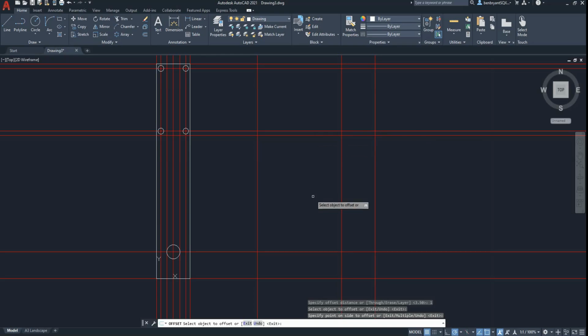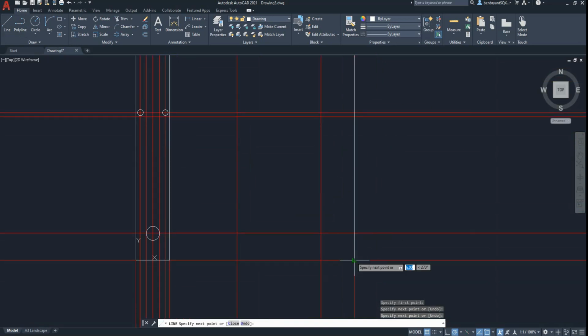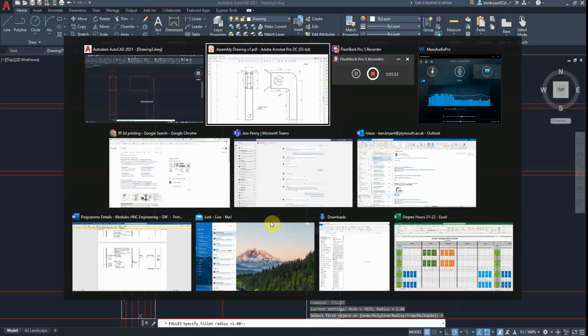So that's gonna have to be, so this can be the height here. That should be 0.25. And down to the bottom, back up. Back on the 2-inch line, which is here. Back across, back up. I actually did put the 2-inch line below by the looks of it. Like so, then we get to fillet. Fillet is radius 1. And then we have another fillet, so radius 0.38.